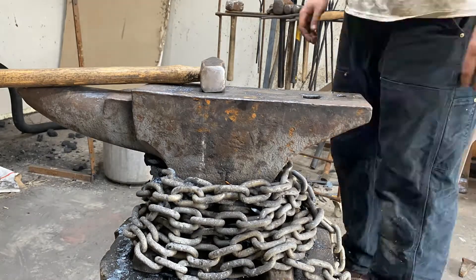I've got the hole punched in. The next step is to take this thing called a drift and basically spread this hole wider, because right now it's far too small for the handle of a hand tool. This will help spread it out so it's big enough to fit a handle. I'm also going to take what are called the cheeks of the eye and spread them upwards and downwards — that gives extra stability and more surface area gripping the handle. This is probably the longest part of making any wooden-handled hand tool like this, so I'll go back to time-lapse. All I'm doing is hammering the drift in, spreading it out, and hitting the cheeks to spread them while keeping that center hole exactly where it is.